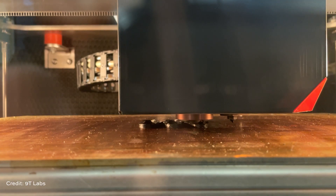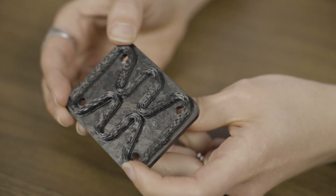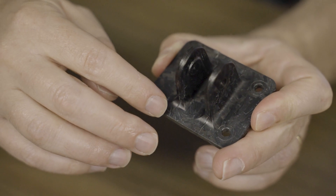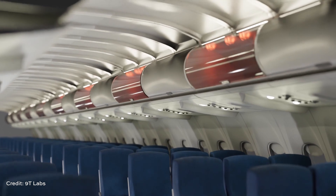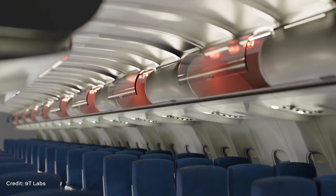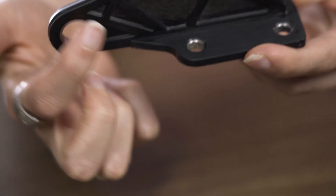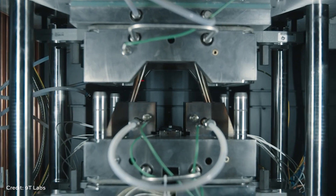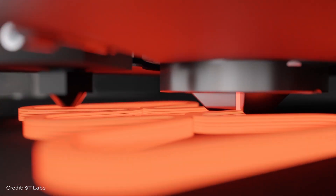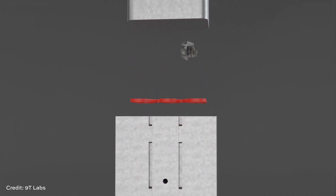Here's some terrain we've covered before: 3D printed composite carbon fiber reinforced polymer as a means of producing strong bracket structures. This is a pin bracket for the overhead bin of an airplane. It was made by 9T Labs and this episode is a follow-up to our previous full-length episode featuring a helicopter hinge bracket also produced by 9T Labs using their additive fusion technology. Basically they are combining 3D printed continuous carbon fiber preforms with polymer composite, bringing everything together with a compression step.